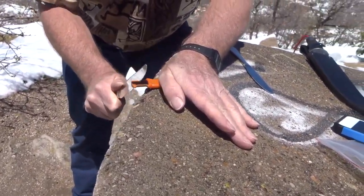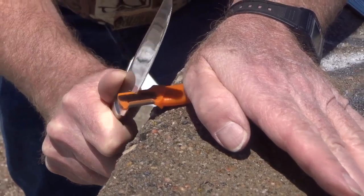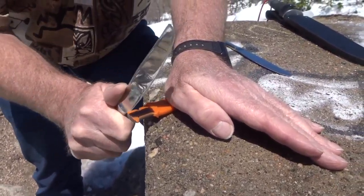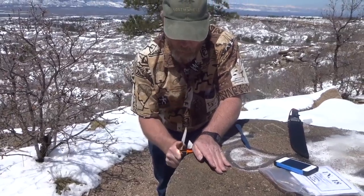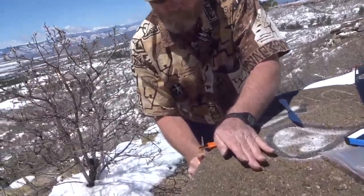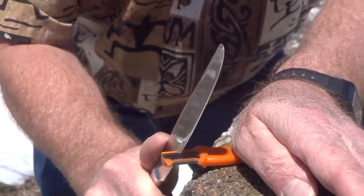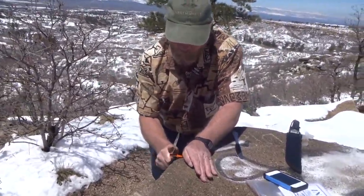We draw it through there and let the carbide cut — you can probably hear the little vibration chatter noise; that's cutting off the serrated part of the blade. The chips are just flying — this is probably faster than a lot of your little belt sanders, although give me an 80 to 120 grit belt sander like the Work Sharp that I love dearly, and I'll make a butter knife sharp in a very short time. We're at 45 seconds, so we'll just work on it here — I'm in no big hurry, I have four minutes.